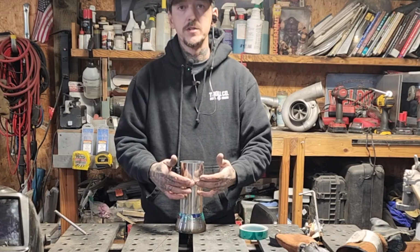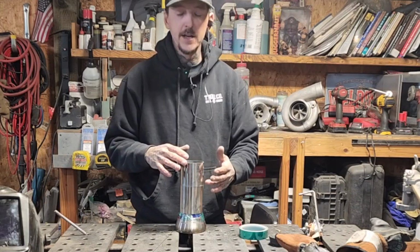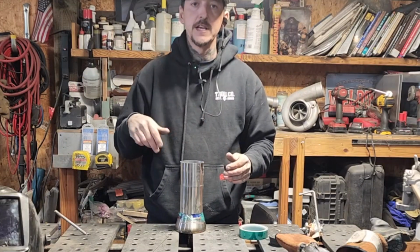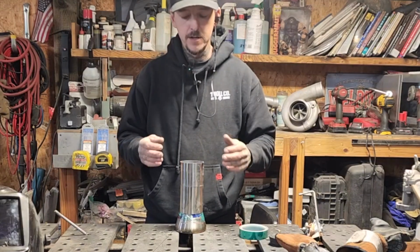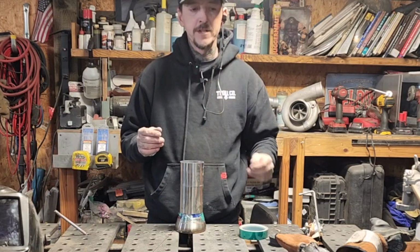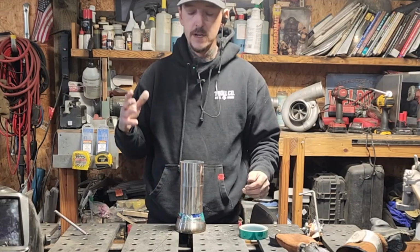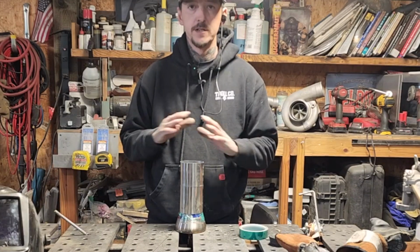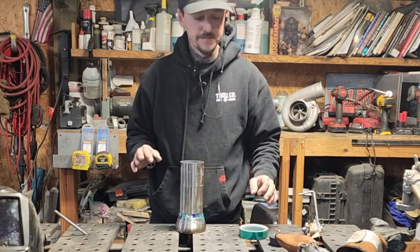We're going to back purge and weld half of the weld, and then the other half of the weld, I'll take the cap off, and you'll see the back side of the weld with zero back purge, and you'll see exactly what I'm talking about. So for some of these guys, especially titanium, it's huge. Back purge on titanium isn't even a question. There's no ifs, ands, or buts. You have to, 100% of the time.